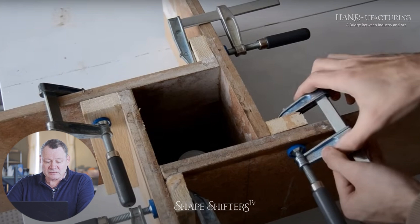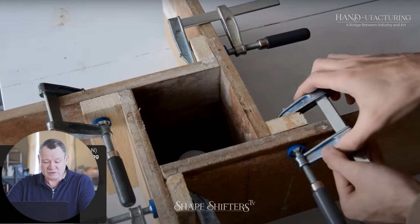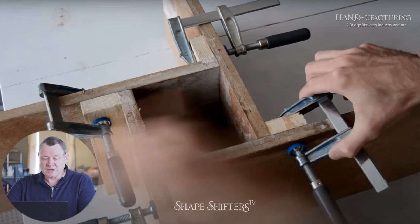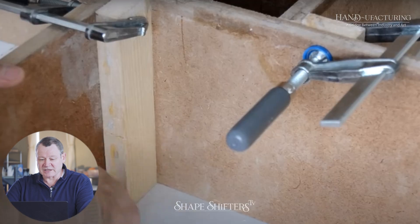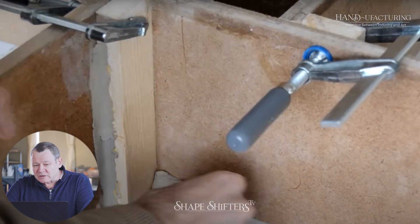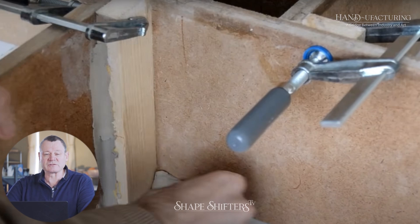These clamps are good for many things, but sometimes a spring clamp on a small mold will work better. If you do use these, this handle needs to be pointed this way so that when the plaster is going into the box, you're not pouring over the handle. You don't want to muck up these nice clamps. It should have a pouring indication line in there too. These boards look like they're particle board. If that is the case, particle board is extremely moisture sensitive and it's just going to swell up and dissolve over a short amount of time. Use plywood or laminated boards.